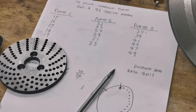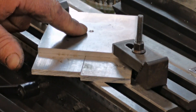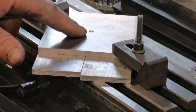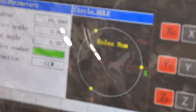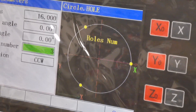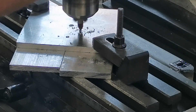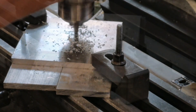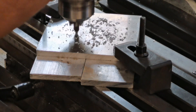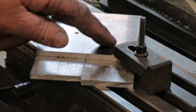If we were doing 80 teeth you'd do two holes per one turn, but as we're doing 96 it's going to be two holes and a little bit - that's why we need to do the maths. So I'm going to make a 24-hole indexing plate. I've marked the center and I'm going to do a three-hole pitch circle diameter for the three fixing holes. I've set the three-hole pitch circle diameter for the fixing holes, and now I'll set a 24-hole pitch circle diameter.